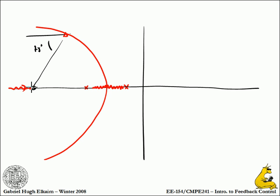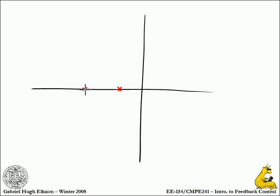So you say, okay, no problem. I'm going to do the next one where we're here, we want to bring up here, and I'm going to bring in the 0 and pop it right on top of that one. Okay? And then 75 degrees away, I'm going to have that one. Okay? So the root locus here is going to wind up doing that. Right? So I've effectively canceled that one.